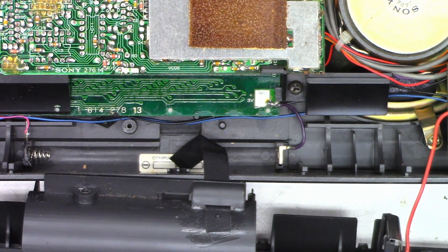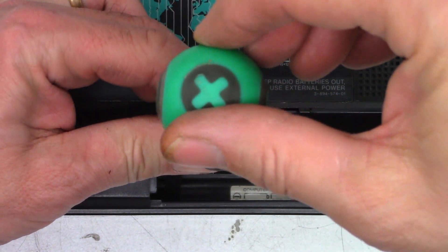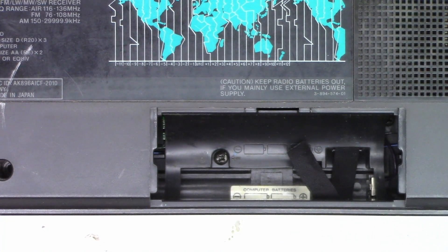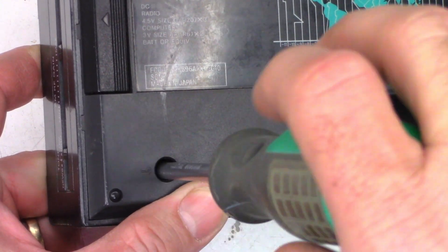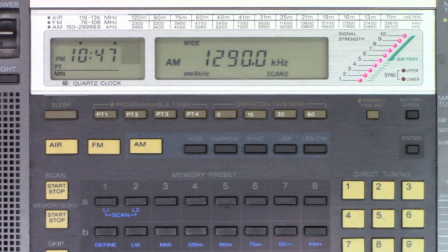Let's get the customer's radio out and finalize it. A quick note for vintage electronics repair: try not to strip out the screws any more than necessary. When inserting a screw, turn it counterclockwise until you feel it drop back into the original threads — you'll hear a click. You don't want to cut new threads into the plastic. Just snug it up, don't over-tighten.